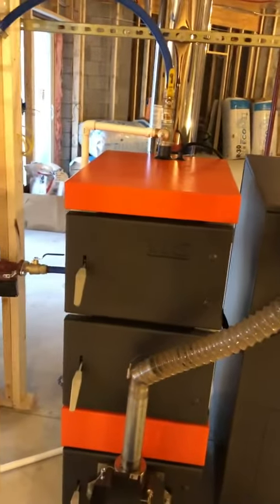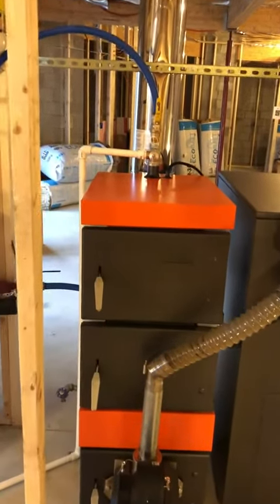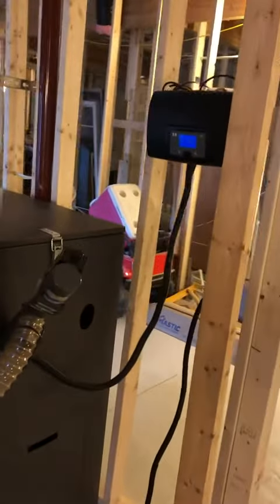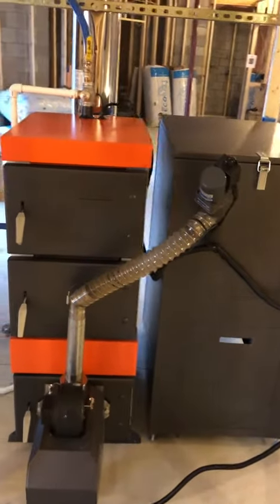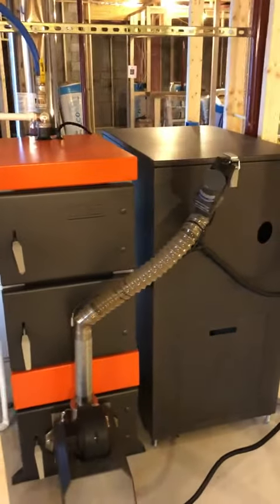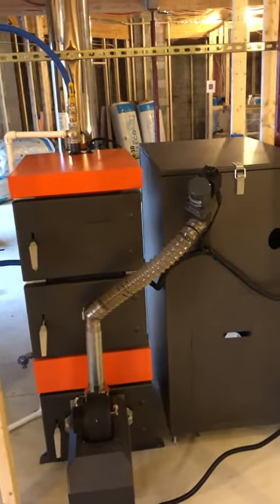We're mainly trying to keep the heating and cooling costs down in the winter. When it drops below about zero degrees, that's when you really get a large load on the heat system, and that's when I wanted to turn on the pellet boiler — just to take it easy on our current heating system. Right now it's heated by two tankless water heaters that can pretty much handle the whole load of the house. Because of startup times, when the heat first turns on both kick on, and eventually after the water's up about 30–40 degrees it drops back to the single boiler.